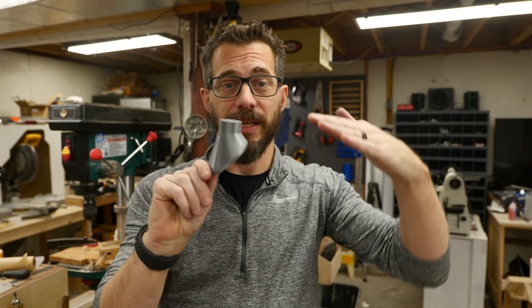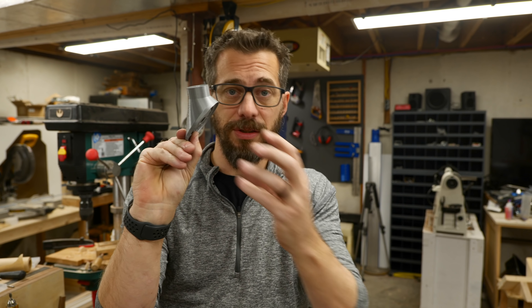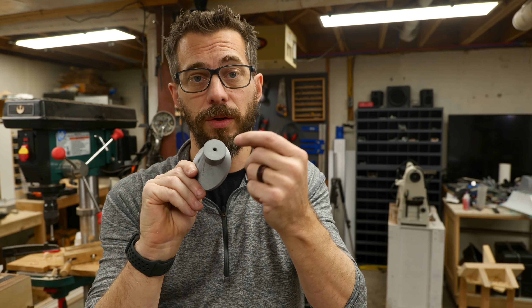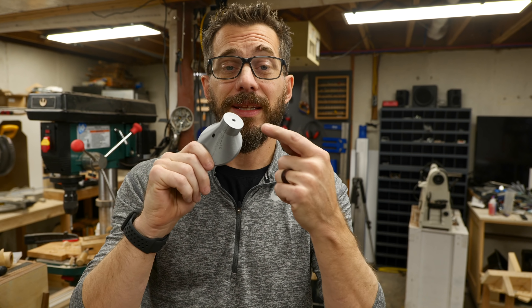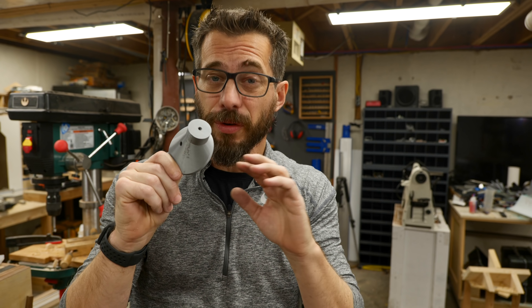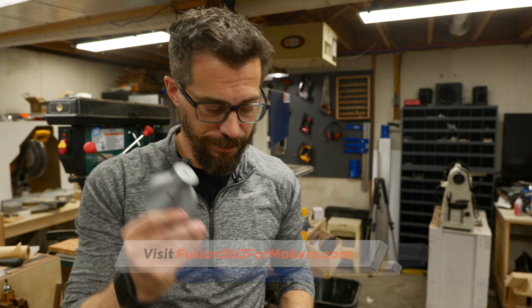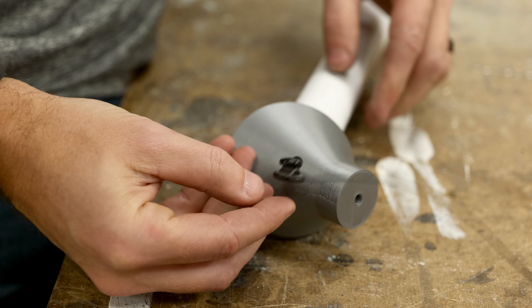This last one is actually going to attach to the trolley so it can slide on the track. It's going to be able to spin and then it'll have the connection to the rest of the arm. So we modeled this one a little bit differently — the wire comes through here and goes straight out the hole in the back so we can terminate it and use the tension to move the thing. On the top side instead of just having a through hole I actually modeled in a quarter-twenty thread so I can put a screw right down into this to mount it up to the plate. Modeling that into a project like this was incredibly easy in Fusion 360. I'm going to temporarily lock this onto something so we can tighten it down and I'll figure out a permanent solution later.